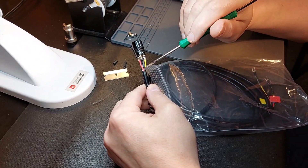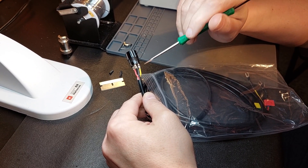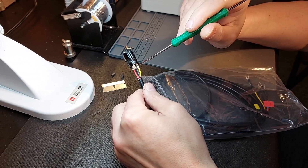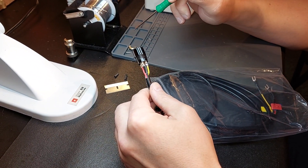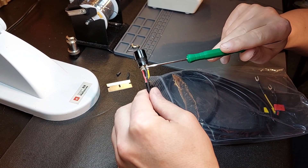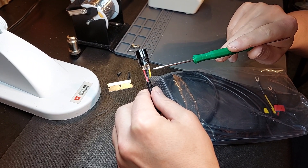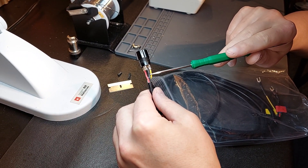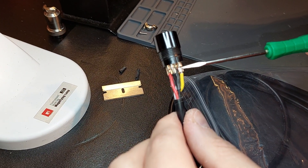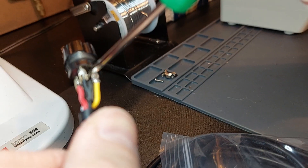What we're seeing on this market is becoming more and more the norm: bulk packaging on high-voltage cables. Number one, the gauge wire is not correct — these are 18 gauge; they should be 16 gauge to support a spindle's power requirement. On top of that, these connectors are terrifying, because remember, it only takes one poor connection. If that connection breaks, I don't care about their heat shrink — if it makes any type of conduction to the ground or another grounded area of the connector, that's a problem.